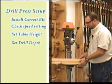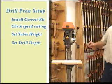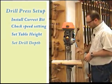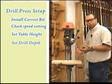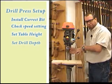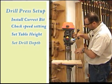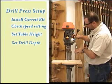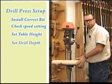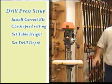Now I'm going to set the depth. I'm going to remove my work piece and loosen the depth collar — so that's all loose. When I bring this down, I'm going to bring it down to where it touches the scrap. I don't want to lock it at that point because the bit has a point and it wouldn't drill all the way through. So I'm going to back it up about a quarter to maybe three-eighths, half at the most. This will allow it to drill into the scrap piece but not into the metal table. Our height and everything is set.